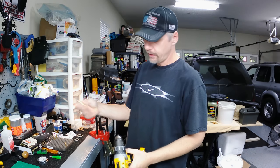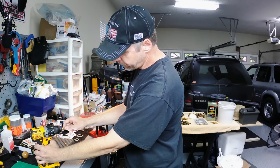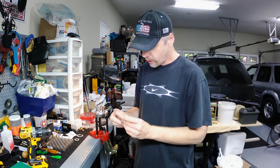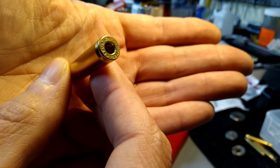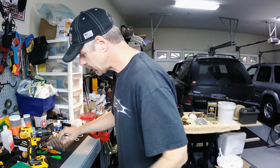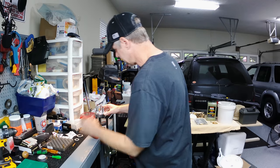Get your glove if you're gonna be doing a bunch of these because you don't want your hands tore up. I'd recommend clamping the drill down with some kind of clamp on the surface, or even get a zip tie to hold the trigger open. Get that bad boy running and boom - done, quick as that. But as you see it slings brass shavings everywhere, so you're gonna want some kind of mat or tray or towel. That's the first method - super quick but definitely the messiest because you're shaving brass off.